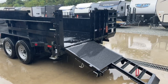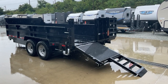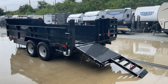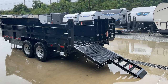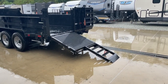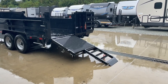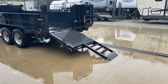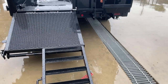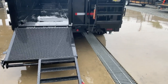It's a surprisingly handy ramp setup. I just deployed it with one hand and slid it to the side — pretty slick setup. I would say this unit would be awesome for an ideal application like a concrete contractor working in an area where they've got to wheelbarrow material up, or maybe somebody who has mulch and doesn't have a machine available. We've had all kinds of different applications that like this setup. It does have expanded mesh on the ramp for extra traction going up. The ramp itself is wider — a traditional dump ramp gives you roughly a 15 to 16-inch ramp; this one is about 20 to 21 inches. If you slide the two together, you'll be double that, and they come pretty well all the way together with only about an inch gap. Not for everybody, but it's a pretty slick setup.